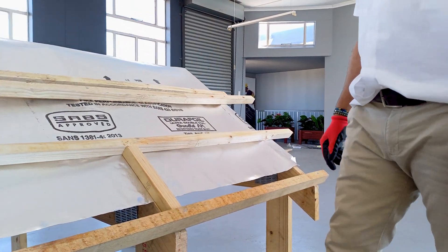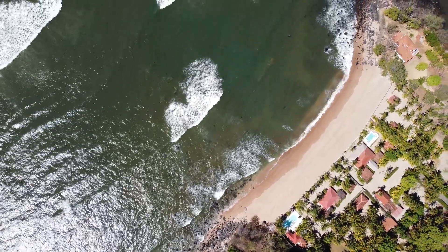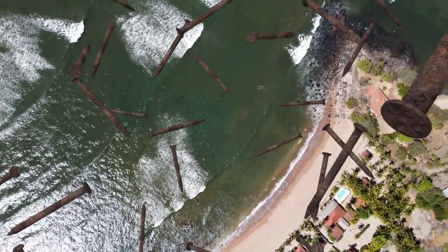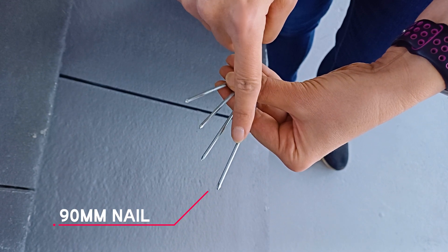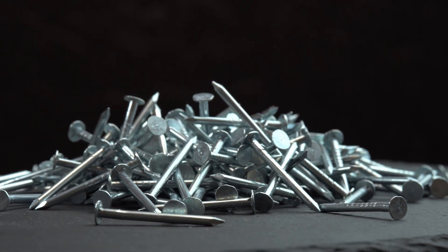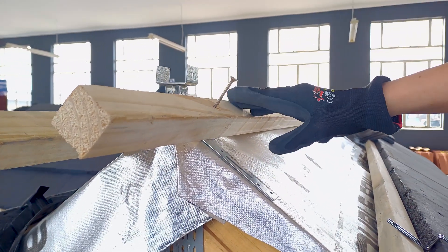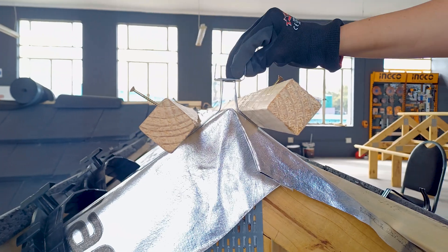It is important to ensure that the nails used for fixing battens are durable under exposed conditions. In coastal areas, all nails or any other fixing components must be corrosion resistant. The minimum recommended nails for a 38 by 38mm batten is a 75mm cut or wire nail, and a 90mm nail of the same specification for a 38 by 50mm batten. All nails should have a diameter of at least 3.35 millimeters. If Marley's dry ridge system will be used, it is best to use a 75mm screw on the apex batten, as this batten would need to be removed and refitted once the ridge batten height has been established.